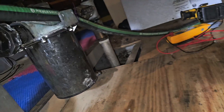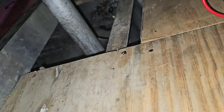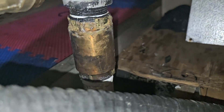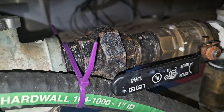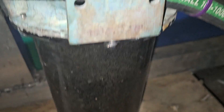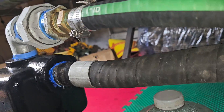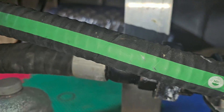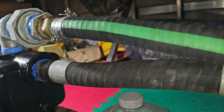This is a pump-and-dump system. This pipe right here brings the water in from beneath the boat. Gotta have a check valve, and then we got a shut-off valve union for taking the filter loose, and a union on the other side for taking the pump loose. Gotta have unions. That is one-inch hose coming into the pump and then one-inch hose going out of the pump.